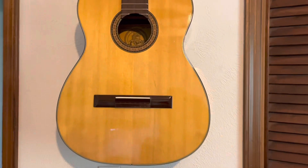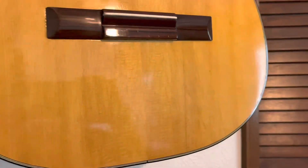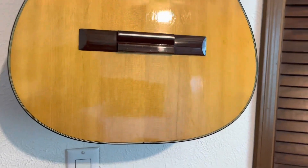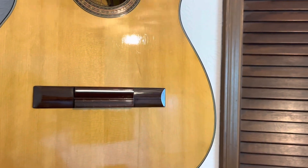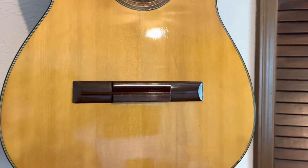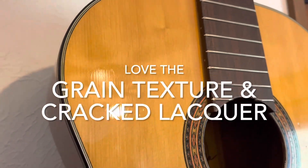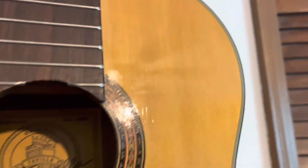What I really want to show is the finish on this guitar. I cleaned up the top — scraped the glue with a razor blade, sanded all the way to 800 or maybe 1200 grit sandpaper, then rubbed it out. You can see the finish still has this beautiful crackle that I didn't remove. It's just that vintage look, and this beautiful glowing color just comes with age and is hard to come by.